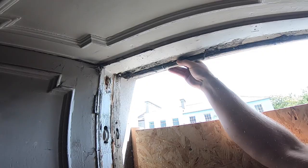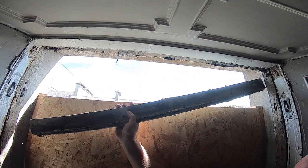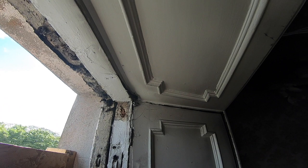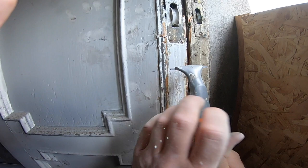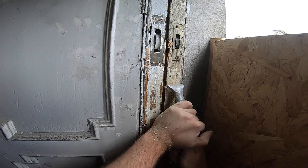We are taking out the outside board because it is in very bad condition, as it's totally rotten and not suitable for renovation. We try to keep original sash pulleys. Scraping, sanding and painting frames on the building site.